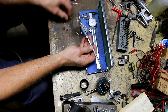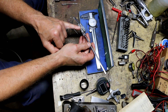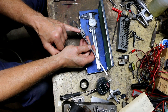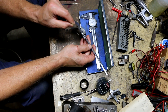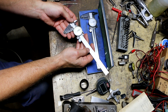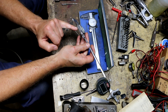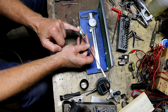On many models, if you remove the bezel locking screw you can get to a slot to put in a flat metal pin that would have been included in the caliper box when it was new but often goes missing. This one is a little bit earlier — there is no slot for that.